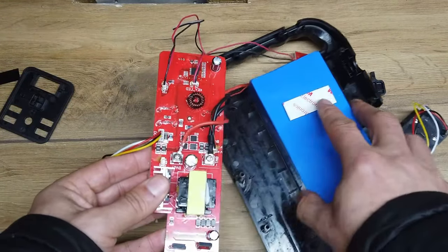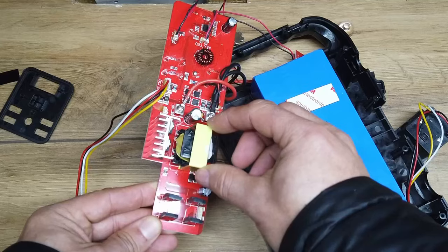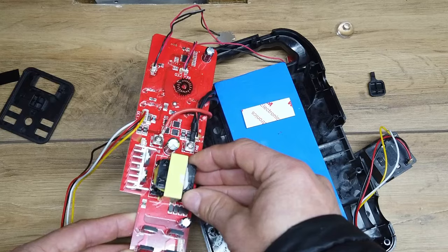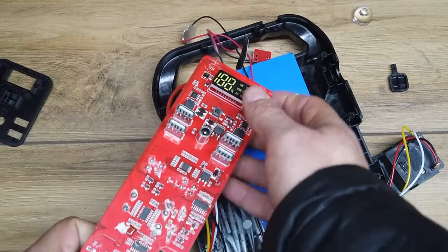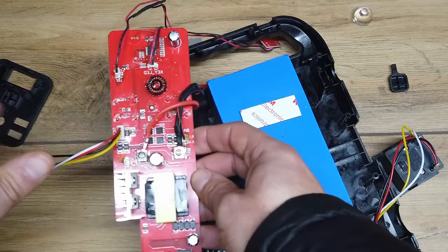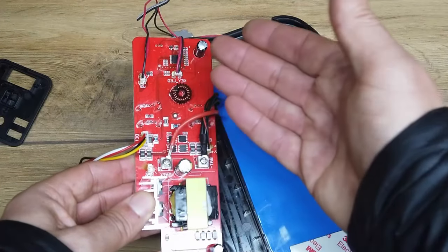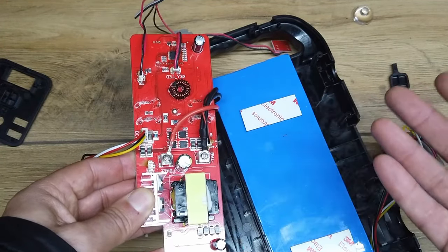I already disconnected the fan, which was on the other case. At the bottom of the PCB we've got four MOSFETs, which are connected to the step-up transformer. The whole idea of all of this is to take whatever's coming out of this battery, turn it into AC, and step it up to 240 volts. There are an awful lot of microchips on here — there's a lot of intelligence in this device. But sadly, that complexity means this PCB has failed somewhere.